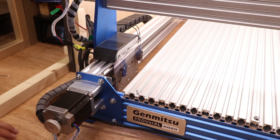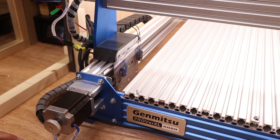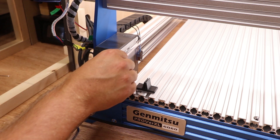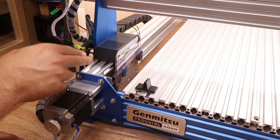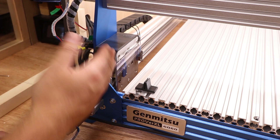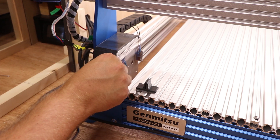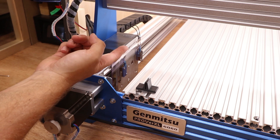The next two modifications are about protection and dust. Nearly everyone with a 4030 noticed that the dust guards weren't high enough to stop dust getting into the C-beam. When you upgrade to the 6060, you don't get any dust guards, so the C-beam is quite exposed. I've cut some clear acrylic or perspex and printed some little feet for it to sit in. I've left it removable so I can still get access to the C-beam for maintenance and lubrication — rather than something permanent — though I may later add a slight arc on top for overhead protection.